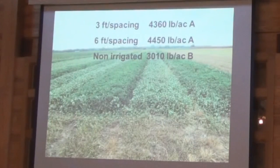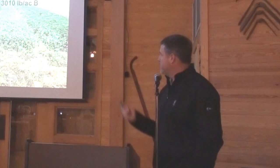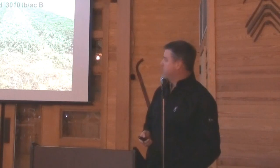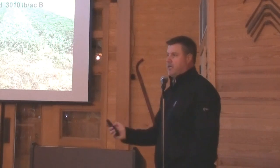This is some of the research we did to show the tape spacings we're looking at — three-foot spacing compared to six-foot. We chose those numbers because we're predominantly 36-inch rows here in southeast Alabama, so if you put tape every other row, that's a six-foot spacing. There was no statistical difference between three-foot and six-foot spacing, so you had a lot less tape cost — you cut your tape costs in half going to six-foot spacing. It also didn't take as much energy to pump that water; tape every three feet meant a lot more water flow and a lot more horsepower. Having it every other middle, you could lower that down and cover more acres at one time with lower tape cost. Since then, everybody has recommended doing the six-foot spacing.